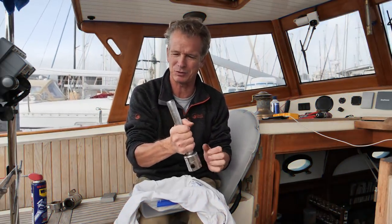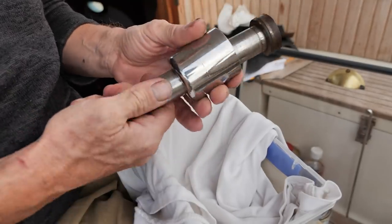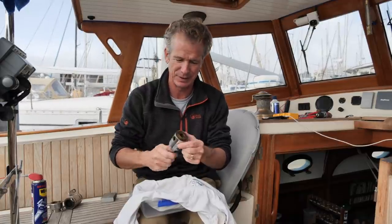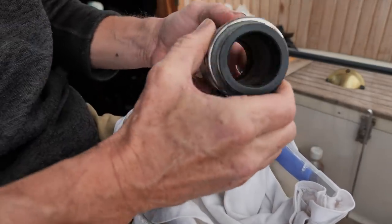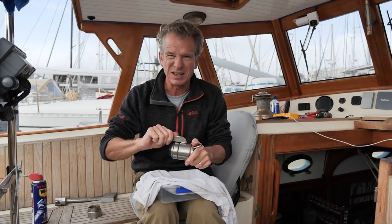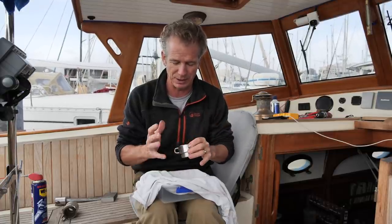This is why I had problems getting the forestay off: the bottle screw at the bottom is supposed to swivel after you take the screw out, but it was seized and wouldn't really turn. It's a good job I slackened the backstay off — that gave me enough room to get it out. I'll clean it up and put it back on, having a look at all the moving parts. The swivel is turning but it's not great, so I'll get the circlip off, have a look inside, and clear it all up. These days you often have polyacetal — Delrin — balls inside, so you should just wash them through with clean water to get the salt out and not put anything on them.